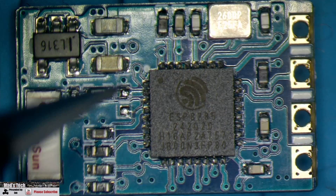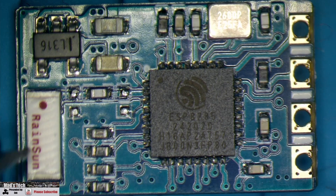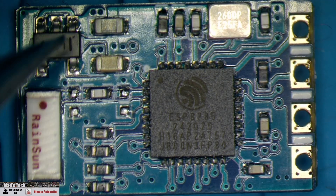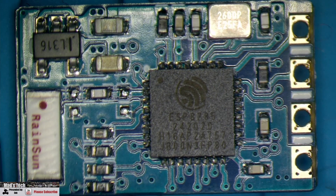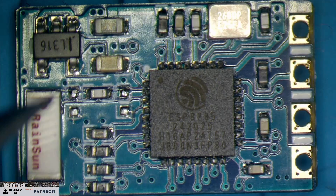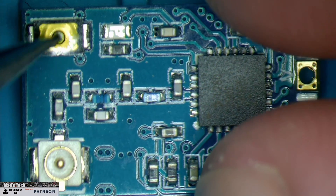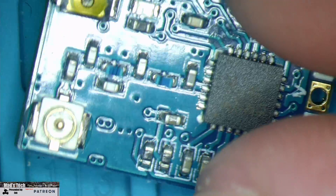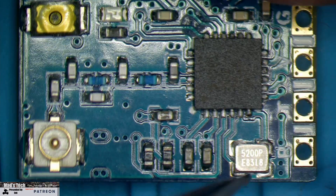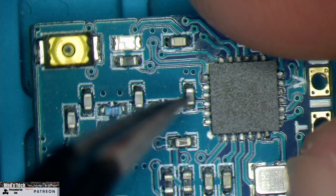Under the scope now, taking a look at the main back side of the board first. This is an ESP8285-based module which has the Wi-Fi updating functionality with the Wi-Fi ceramic antenna over here. We then have our clock and our little voltage regulator. On this side of the board everything is fairly straightforward — we've got components laid out, resistors and capacitors, all looking nice and straight with no issues at all. Spinning the PCB over to the other side, we can find our UFL connector, the button, LED, and the other chipset which is the SX1280. We've also got our real-time clock and inductors on the RF stage.